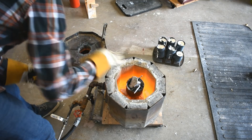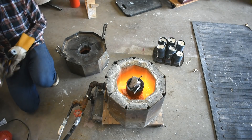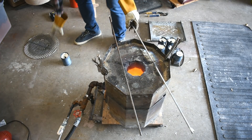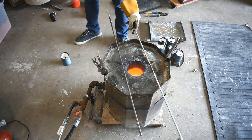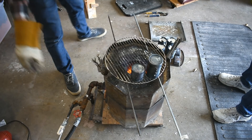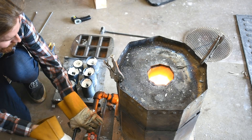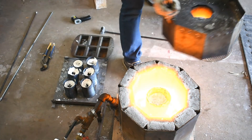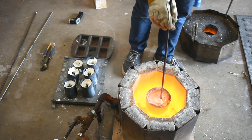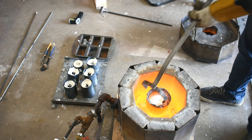I also used to think you didn't want a lot of hydrogen to dissolve in the aluminum because of porosity, but I've watched a lecture recently that kind of calls that into question. Not that hydrogen forms porosity — it totally does — but there are lots of other reasons for porosity, but more on that next week. What I did is put a grate on top of the furnace and set the cans on top upside down so any remaining bits could melt and fall out. They were already preheated and kept really, really hot, so when I poured in the aluminum, it didn't hit cold plaster and freeze before filling the game pieces. I also tried light salt — the flux — sodium chloride and potassium chloride mix, supposed to make the aluminum more fluid.